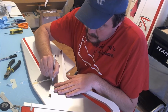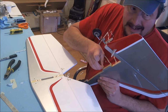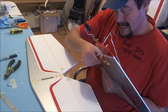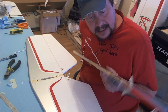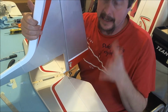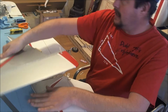We're probably going to use a 20 drop ratio. Goofy. The metallic stuff, it don't want to bond, but man, when it bites, it grabs a hold. All right, just like that, all of our hardwood is exposed. Now, I'll tell you right now, you don't have to epoxy this. You can just bolt it together if you want to. I'm just going to epoxy it for peace of mind so that I know it's not going to come apart. And I'm going to use the bolts to pull everything and secure. That way it's nice and square as well. So let me thaw out some epoxy and we'll be right back.